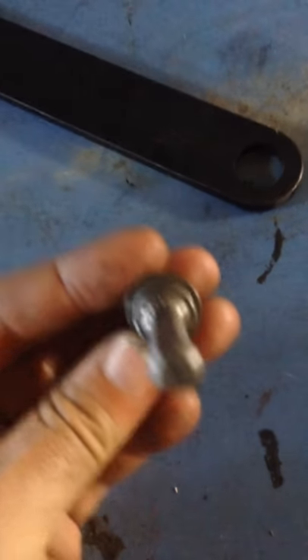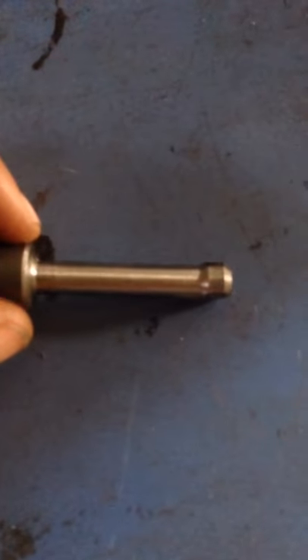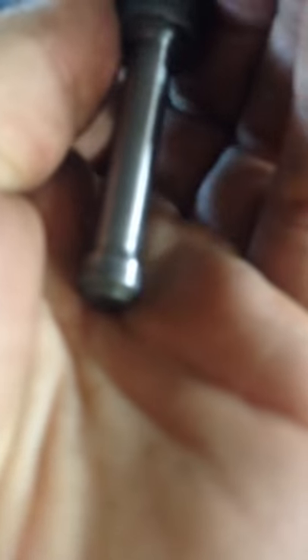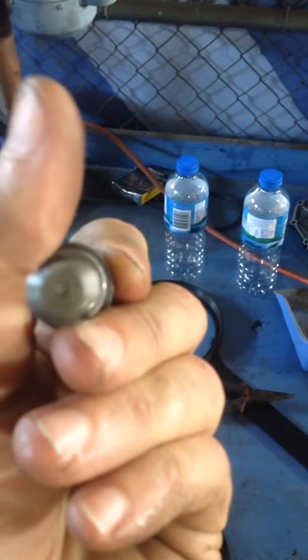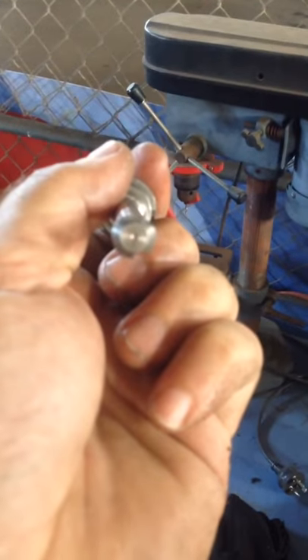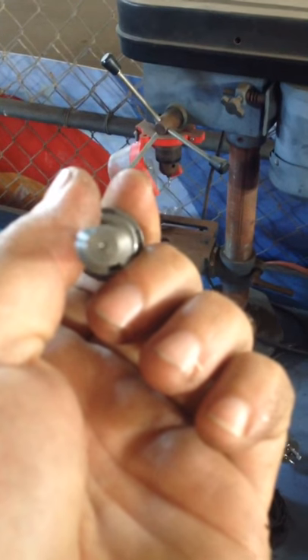It's a bit dark in here so you can't really see it. Machining it down — this is hardened steel — it's tough going. I went really slow; it took about half an hour. I left the original channel as the other forum member also did, and then I flattened this part. Pretty much I doubled the channel.